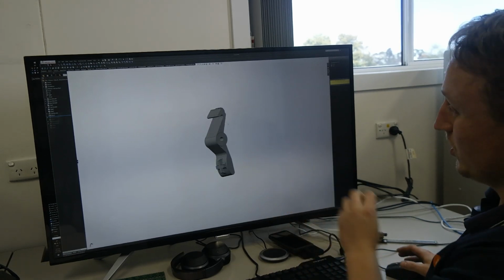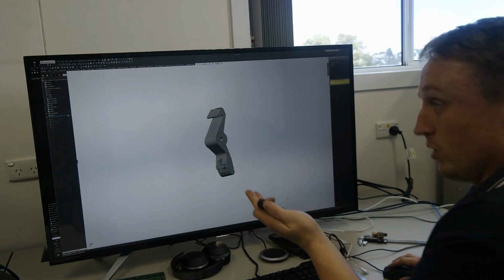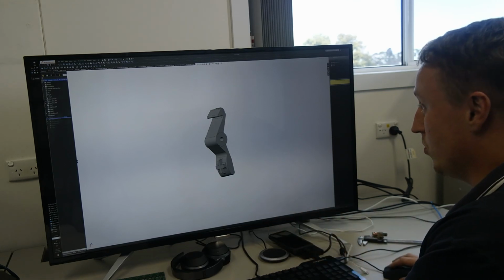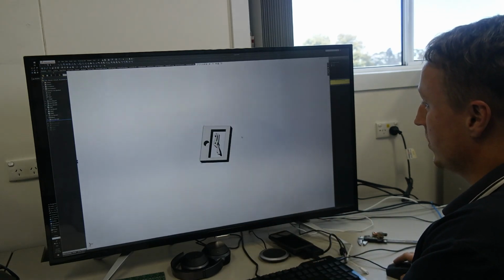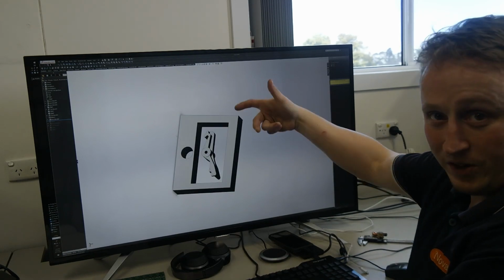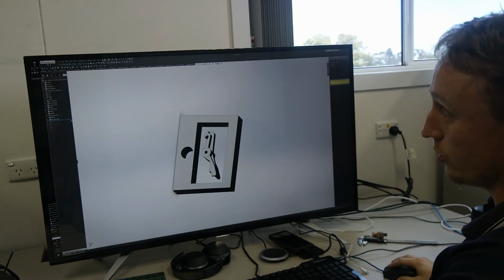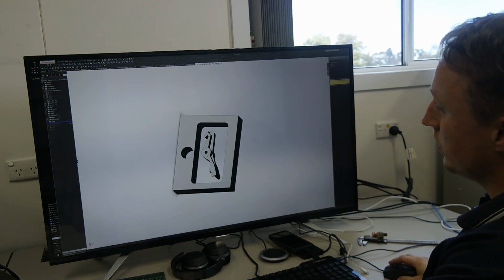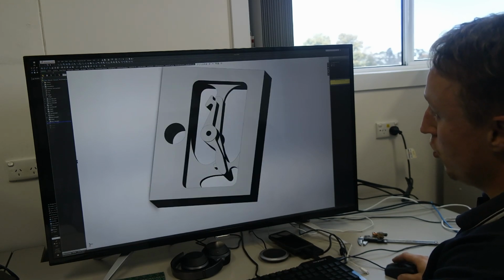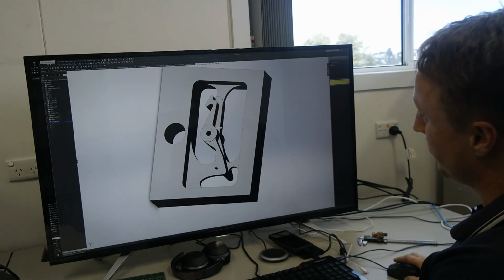That's all well and good, but we still need to machine it out of a block of aluminium. So what I've done is I've included the block of aluminium in the SolidWorks file. I've left a big circular cavity so that when we flip the part over, we're able to find the exact center location again, or the origin I should say. Then I've added some support material so that I don't have to make a special jig for when this flips over.